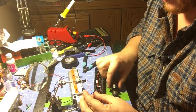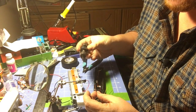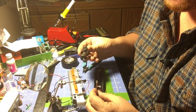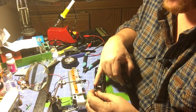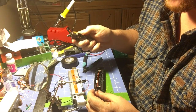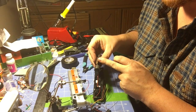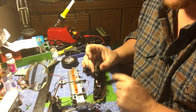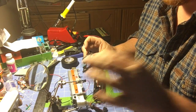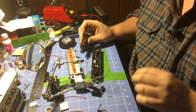So we also have the orange and gray wires, which according to the directions go to the left and right, which in translation means on the actual motor, the bottom and the top. The right pickups go to the top, the left pickups go to the frame, which goes to here. Since this is going to be isolated, I'm going to put a small little jumper wire to bring it up here so that when we install, I can kind of keep everything up top. And the wires from the decoder are pretty easy to get.